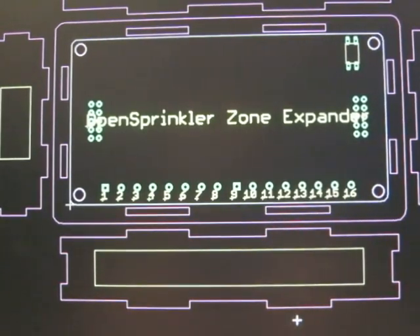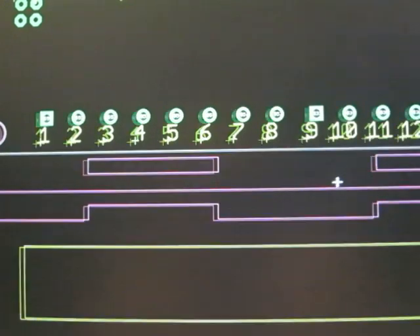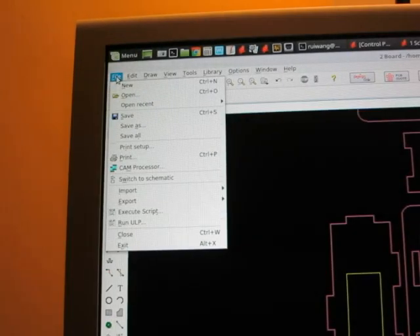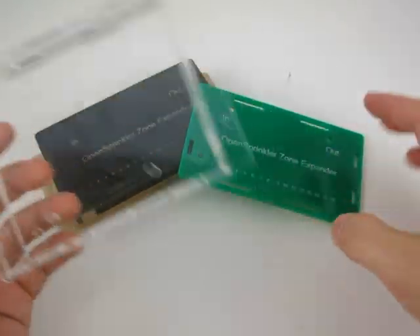You can also easily add text engravings. For example, if I need to add labels for the connectors, I can create text labels aligned with the connectors. The additional cost for adding text engravings is pretty minimal. When everything is finalized, I usually export the acrylic and cutout layers to a DXF file, convert it to Adobe Illustrator format, and send it to the vendor that I ordered from. I'll tell the vendor the acrylic thickness and the material color. The most common material is transparent, but you also have various other colors to choose from.